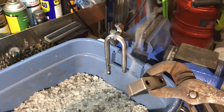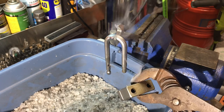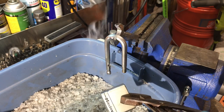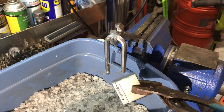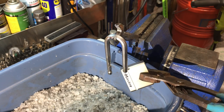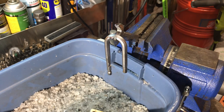There really isn't a whole lot we can see here, but I'm assuming that the actuator melted and that allowed the ball bearings to move in and we opened it up. Usually on most locks you would find that zinc part made out of brass, which has a much higher melting temperature, but it looks like Master Lock tried to save a few cents on this lock and because of that it opens it up to a new attack. That's all I have for you today — if you have any questions or comments please put them below, and if you like this video and would like to see more like it please subscribe. As always, have a nice day.